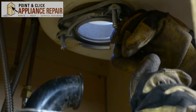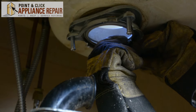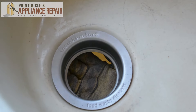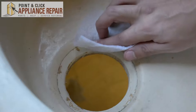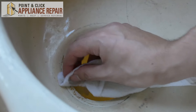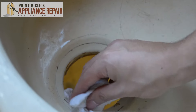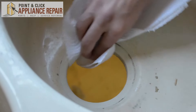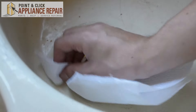Now I've got the retaining ring, and I'm just using a flat head screwdriver to pry that off. I'm going to hold onto this stuff so it doesn't fall down on me. Now you should be able to push up the old sink flange. I'm going to use a wet paper towel to get the rest of this old plumber's putty out, clean it all off so I can make room for the new stuff. Do as best as you can to get it all off — you want to make sure that we've got a nice watertight seal. Now I'm going to use a dry paper towel and make sure we dry our sink out right where we're going to be putting our new flange and putty.